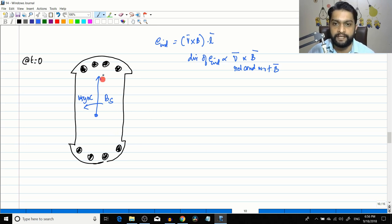Since Bs is moving counterclockwise (right to left), the relative velocity of the conductors is taken as left to right. This is like a stationary conductor seeing the field move — from the conductor's frame, it moves in the opposite direction. This concept was explained in depth in the AC machinery fundamentals series.